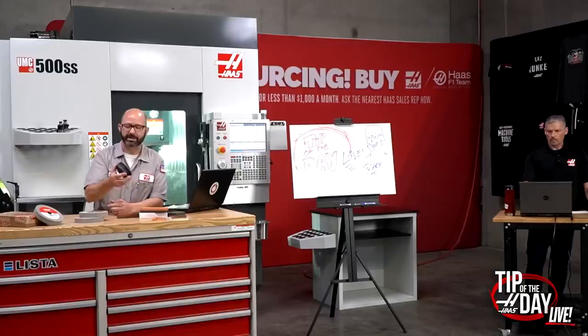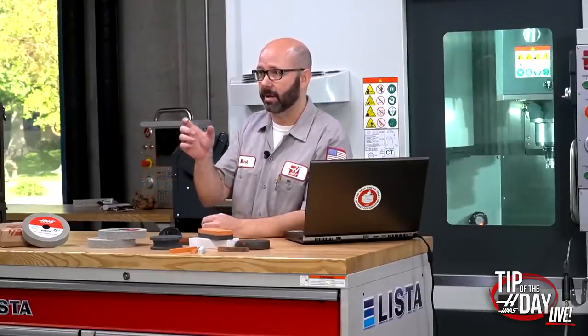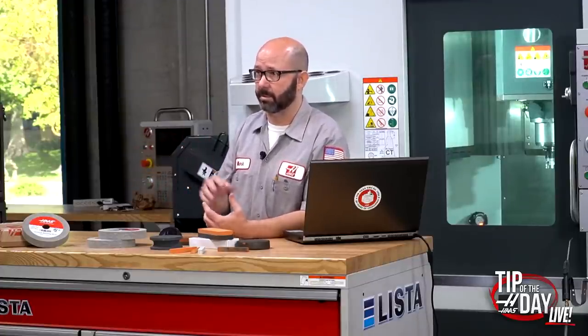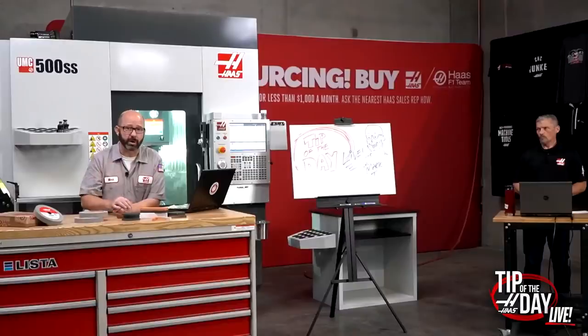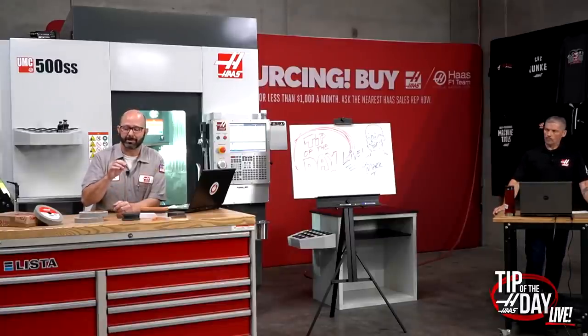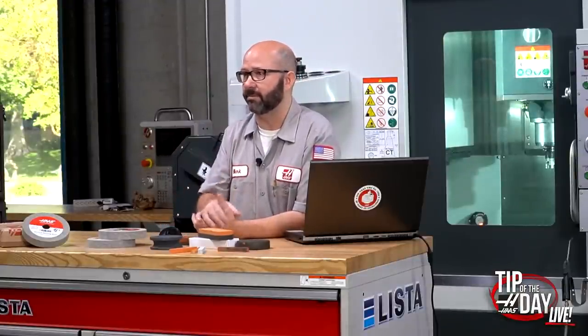You can see something like this silicon carbide. We use tungsten carbide end mills in our machines — carbide is just carbon mixed with some type of metal. Tungsten carbide is tungsten mixed with carbon. Silicon carbide is a really unique material. It's basically a crystal and it's super hard — right up there with diamonds. Because it's a crystal, it's best embedded in some other type of wheel using resins or a vitrified wheel to hold it.